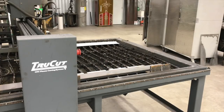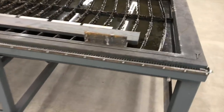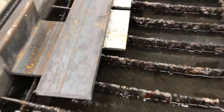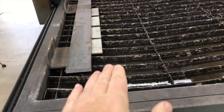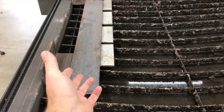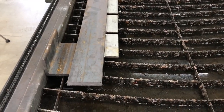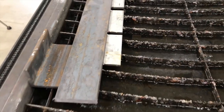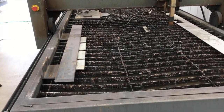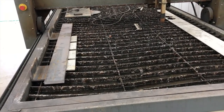So here's what I ended up doing. I took the two inch flat bar over to the bandsaw and cut down the pieces at the right length. Then I put some tacks on each end and tried to keep the tack low and to the side as much as possible to keep these guys from wanting to raise up. I tacked it to some three quarter by four flat bar — very heavy, very rigid. The only concern is whether the tacks will hold up. We're going to use the rip cut feature in Mach 3, which is basically clicking a couple of buttons and you're ripping away at it.